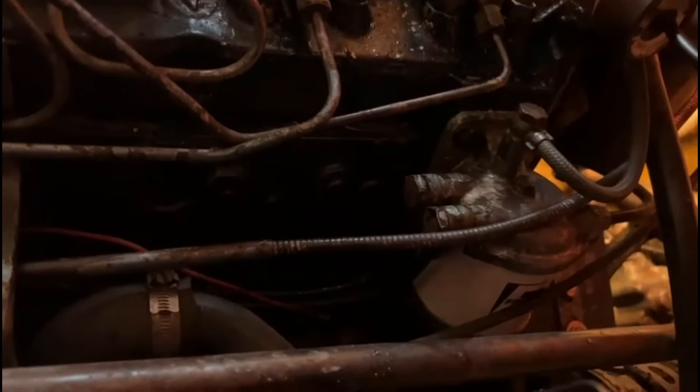What I'm going to attempt: I've got the coupling off the prop shaft at the back because that had a damaged constant velocity joint. I think if I take the bolts off and disconnect the exhaust, water, and fuel lines it should be all right. I should be able to hoist it about a foot and then put some planks of wood in to straddle it. Anyway, we'll see what happens.